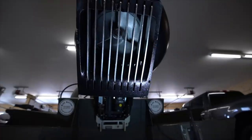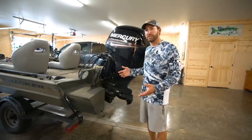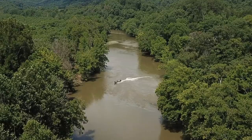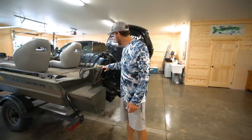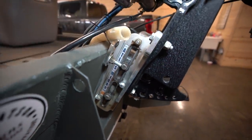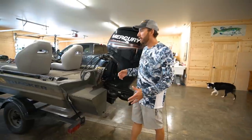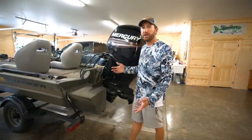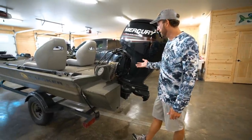That's the motor I run on it now and I really love this jet engine. I've had a really small one before on a flat bottom boat, but this is definitely the biggest jet I've ever had. It's so awesome how the places you can go with it. With the prop setup I had, I could run really shallow but needed a little water to get on plane. With the jet, basically if I'm floating, I can probably get on plane pretty easily. It's a Mercury four stroke 9065 jet, attached to the boat with an Atlas Micro from TH Marine — about a four inch setback hydraulic plate. With the jet, I don't vary that plate a great deal. Depending on load, I may raise or lower it a quarter or half of an inch.